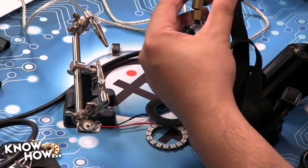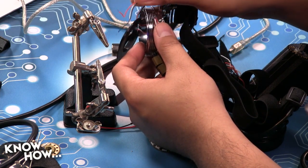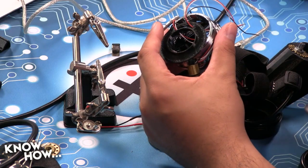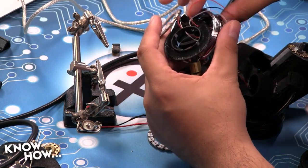That's good to know. Okay. Yeah. Good. And then all you need on this side is this has to solder into the Arduino. This goes into ground, 5 volt, and pin 3. Okay. And how does the potentiometer hook in? A potentiometer hooks into ground, 5 volts, and then analog 7. Okay. Yeah. There you go. That's for you. Thank you.